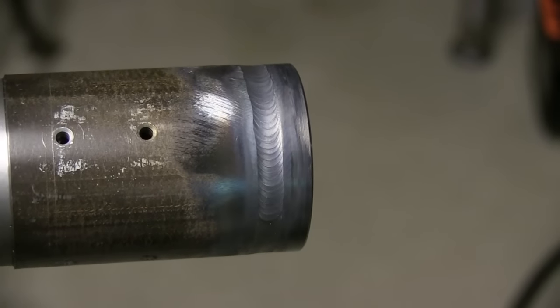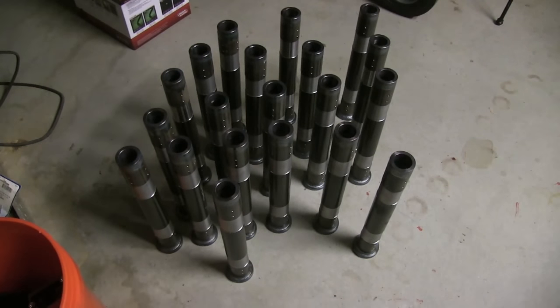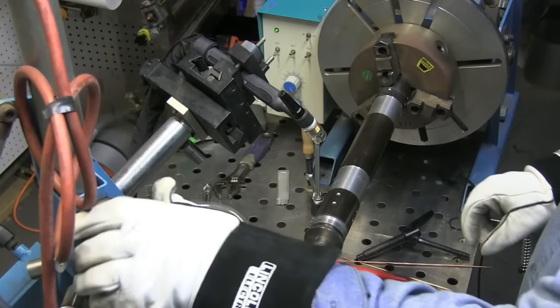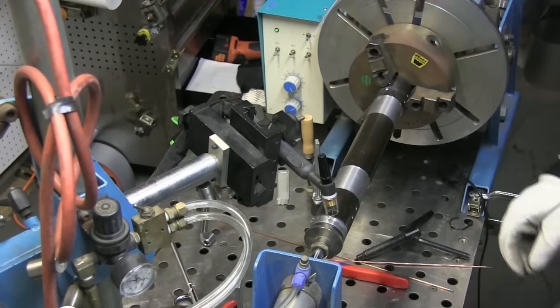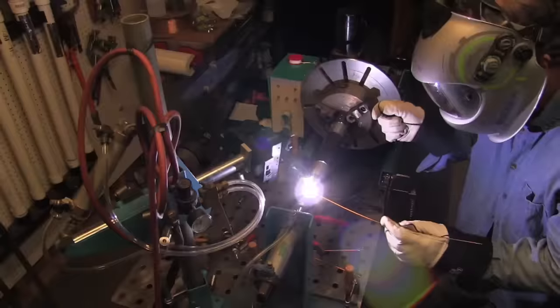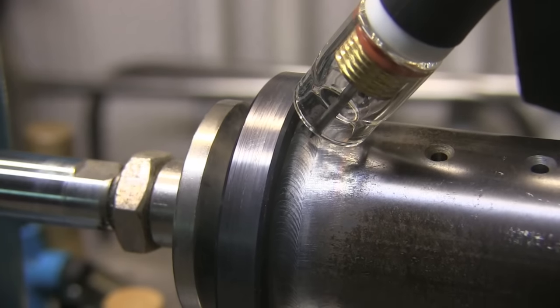You can see there's a little bit of variance in the width there, but that'll cure itself when I hook this up to the welding lathe. I've got a whole bunch more of these to do, so in a future video I'll show the setup with the torch holder and actuator — it does a much nicer job. See how much more uniform that weld is compared to the one where I was propping by hand.